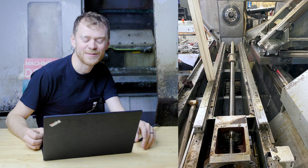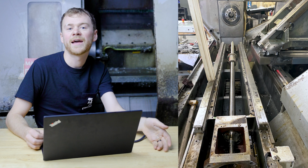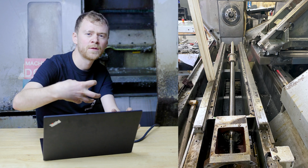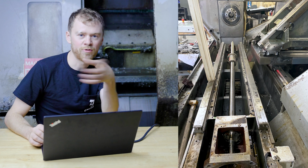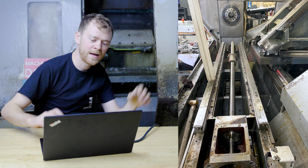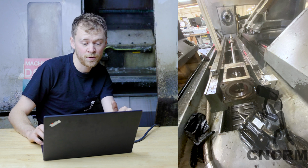I ended up just grabbing a spindle liner to hold up the sheet metal for the ceiling, but got the sub plate off from the front. I could get the bolts that hold the ball nut into the yoke, got that out, then pulled the motor out, then pulled the ball screw out. Then it was time to pull the rails off. Ended up getting new coupling for that motor.